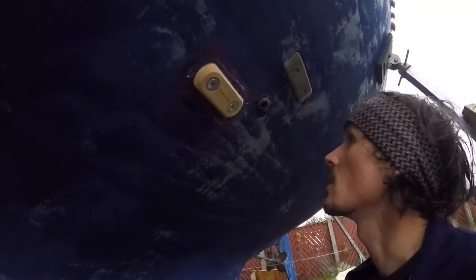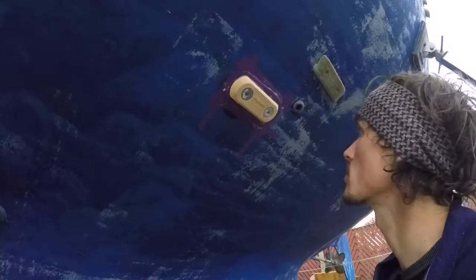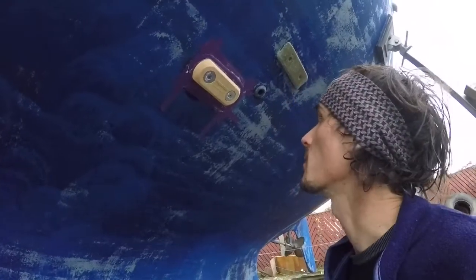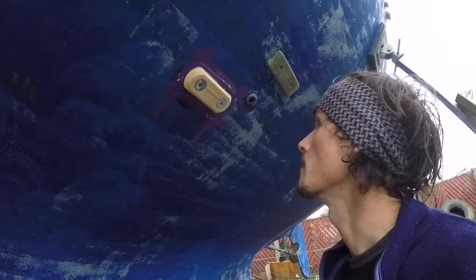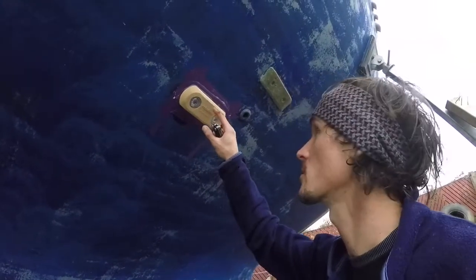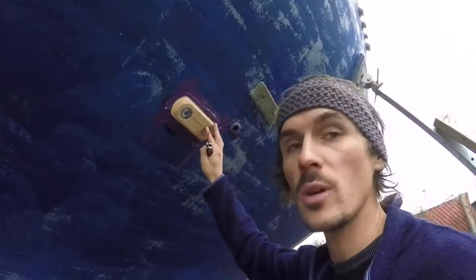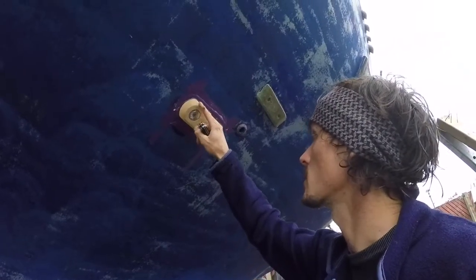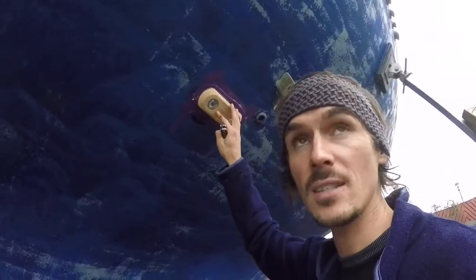Right, so there it is on the boat — hole drilled and keel cooler pushed in and locked down. For those of you who might be watching this and decide they might want to put one of these on their boat: put a shitload of masking tape on this first. Because what ends up happening is all of the goo ends up coming out the side and going onto it, which is usually not a problem. But for this it is a problem because it's porous and it allows all the water to go through it and circulate around and basically act as a heat sink.